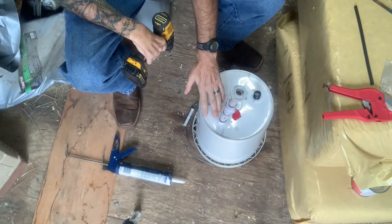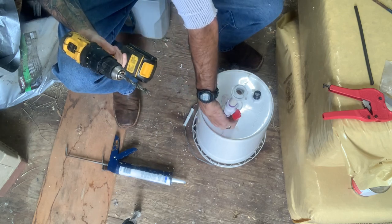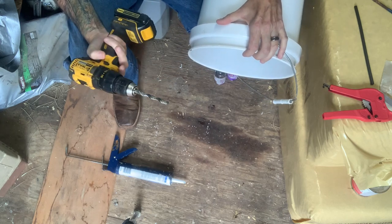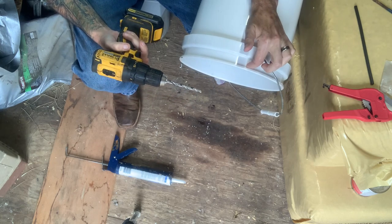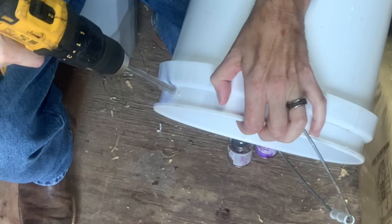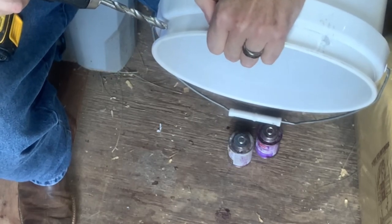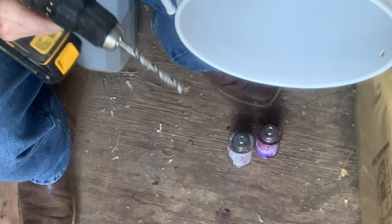All right, the next day — silicone is all hardened up, everything is good. I did lie to you; I need just a couple more little holes. Where I'm going to put these is using like a three-eighths bit — you can use whatever you have, even a screw. I'm going to put probably three or four holes just in this lip here. Those are just vent holes to make sure we don't have any vapor lock issues and to allow the water to flow out, because this bucket is going to have a sealed top on it.